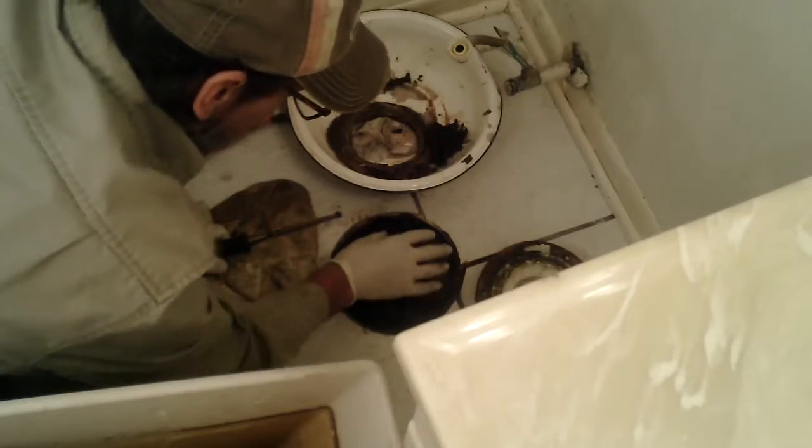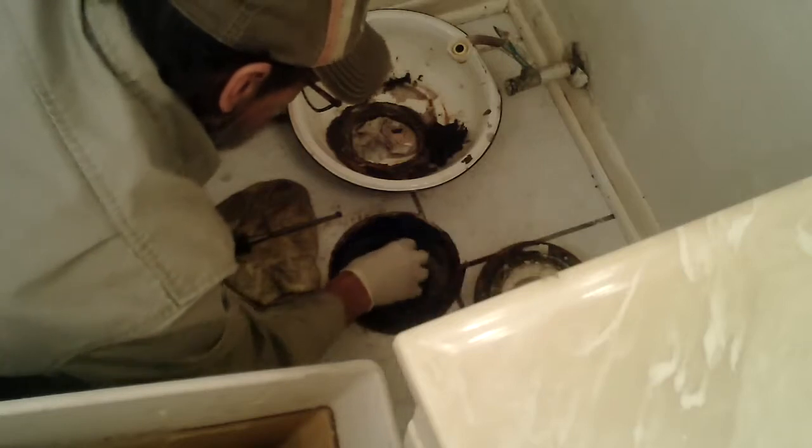And the toilet, because this won't seat in there, is loose. The toilet teeters here. It's bolted to here, so this has to be secured deep into the pipe. I put a rag in there to keep all this trash from going down the drain. I'm going to take the chisel. Firstly, get the loose stuff off.